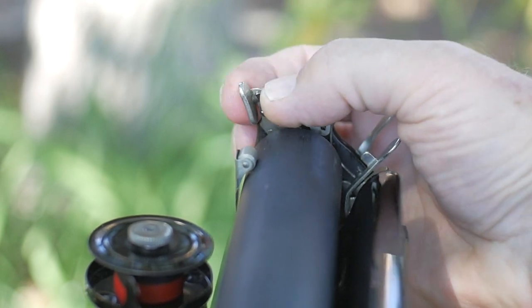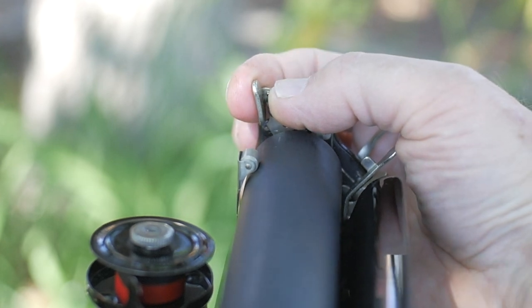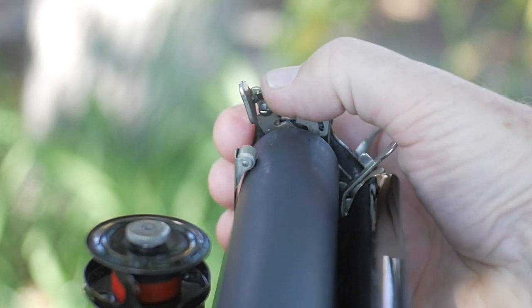Here's another shot from the back side of the line advance lever. This little pawl that you squeeze enables you to turn the platen backwards — otherwise the ratchet is locked in that direction by this little lever.